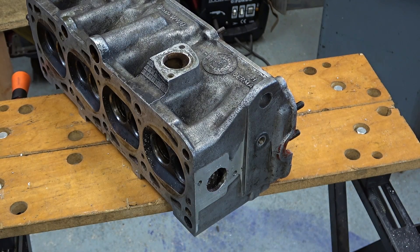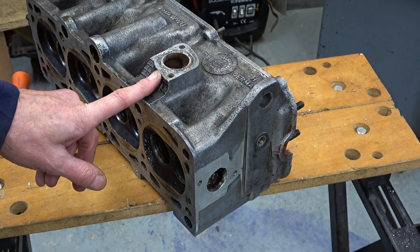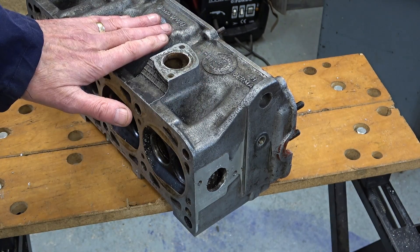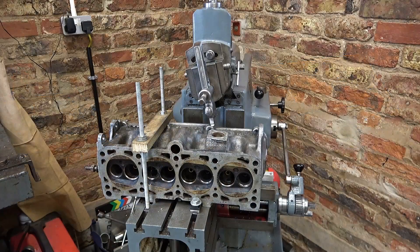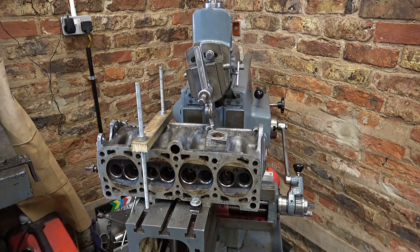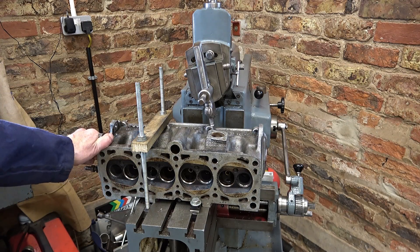Now having done that for my son, he then said, 'Well what about this one?' Well, really? Okay, but it's not so corroded and it's pretty thick here, and I think I can just do a machine skim over the top on the shaper. So it should be a fairly quick job. I've got a bed clamp on there and a bed clamp at the back as well, plus two long straps and a piece of wood here — and this isn't going anywhere.